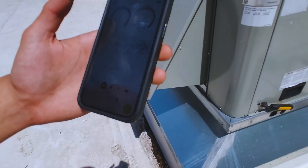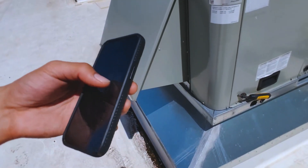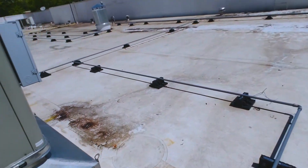So what that's meaning — it's 300 more than the hose now. Look at that subcooling as well — yeah, it's pretty high. The superheat kind of stabilized on us though. So based off these pressures and temperatures right off the bat, you can tell there's issues with heat rejection due to that elevated head pressure and liquid line temperature. Those are the two main things you want to be looking at when diagnosing whether your condenser coil is improperly rejecting heat — whether it be due to a dirty condenser coil, a weak fan, a weak condenser fan due to a weak capacitor, or even the fan blade being too high or low within the actual shroud. These are just a couple things to look at whenever diagnosing heat rejection issues. That's an indication of improper heat rejection.